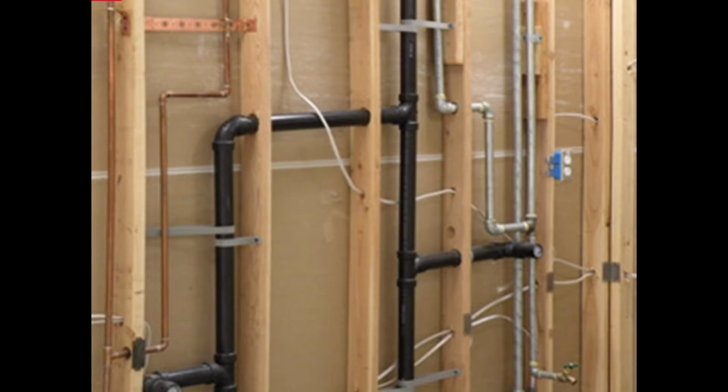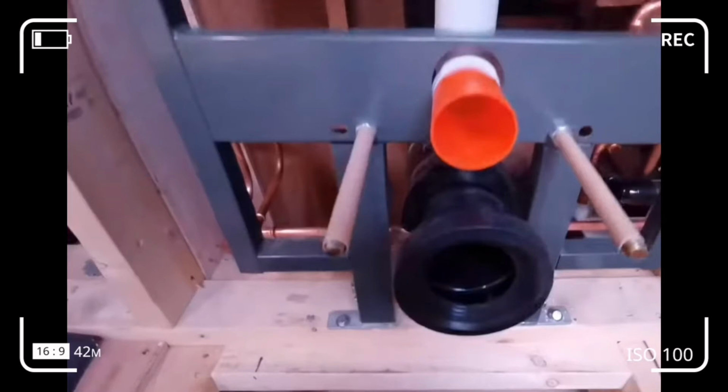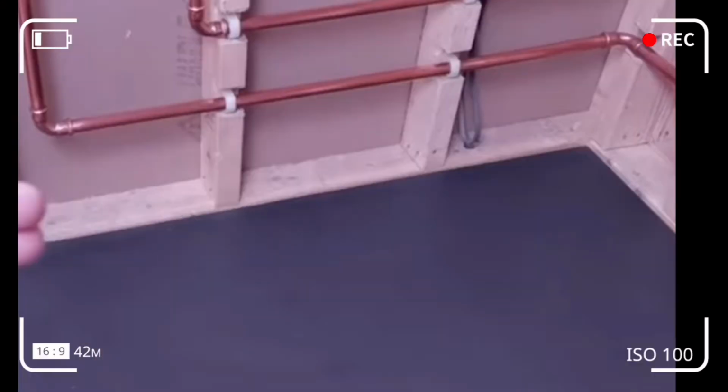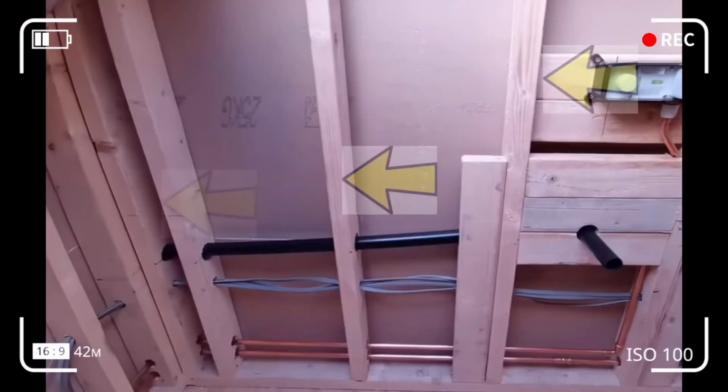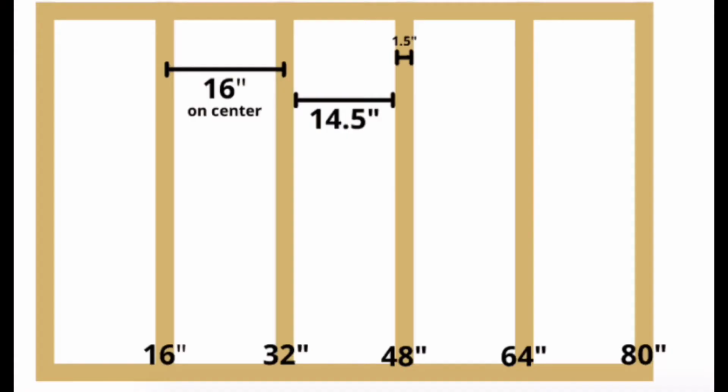Suffice to say, every wall is different. And so I recommend that if you're going to work on any wall, you properly map out the wall, which means plotting several studs at multiple heights, even if you're looking for only one stud. Because you would want to make sure that the stud you do find is actually a stud, okay? So the Franklin yellow stud finder that I'd be using is pretty much a rough guide. It is a density detector and will locate any dense item behind the wall, not just the stud alone, okay? This invariably means that it could also pick up on pipes, wires, conduit, and plaster keys in lath and plaster walls. It could also pick up on structural features like double and triple studs, and the rare diagonal support beams.